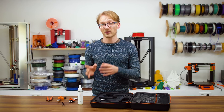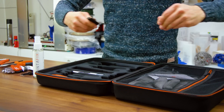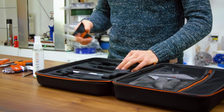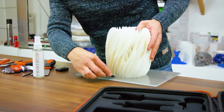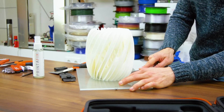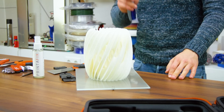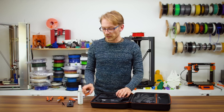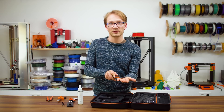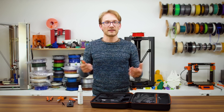Once you've finally managed to get that print stuck, there are a few tools that help you with removing it again: this razor blade holder and the sharpened spatula. The general idea is that you'll start out by sliding the razor blade under the edge of a finished print and then follow up with the spatula to completely remove it. I've personally moved on to using a sharp chisel, laying that flat against the bed and then jamming it under the print, but pulling that off without damaging the print or the print surface requires a good bit of practice. The spatula in the printer kit is specifically sharpened with a two-sided grind, so it's hard to slide directly under a print, but it's also much harder to damage the print surface should it be using PEI or BuildTak or anything like that.